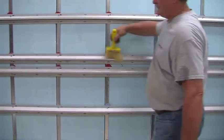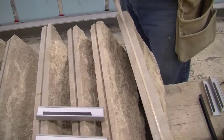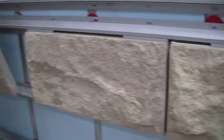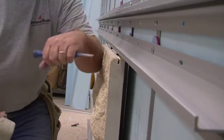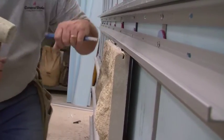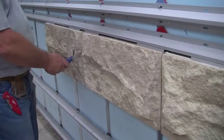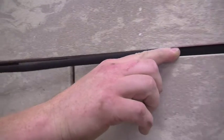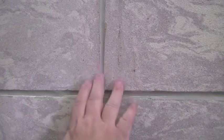Sweep out all of the channels getting rid of any debris. To put in your stone: caulk the top kerf in the stone, then insert the L brackets — you need one L bracket for every 12 inches of stone. Set the bottom of your stone into the track, then positively engage the stone with your elbow and use a hammer and chisel to snap it into the top track. Use your chisel to maintain a 3/8-inch gap between stones. Repeat the process with Profile Eris Clip and with Smooth Eris Clip. Fill all joints between units with backer rod and install silicone sealant over the backer rod, then smooth it over with your fingers or a tool and let it cure.